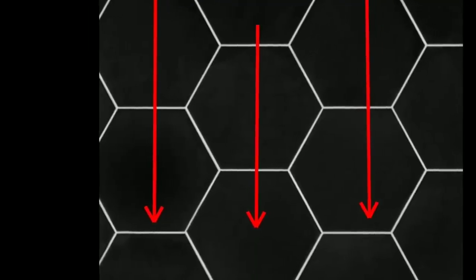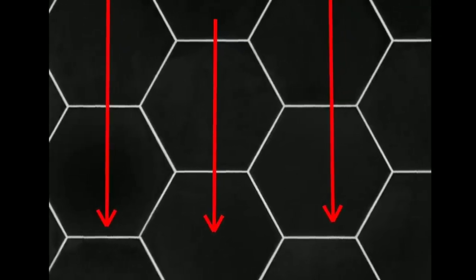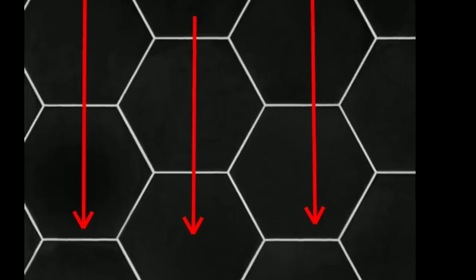The reason for this is how the superheated air reacts to the seams as it flows over the tile. When laid out in this manner, there are no seams in the direction of airflow. This deters deterioration due to extreme heating.